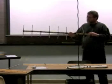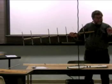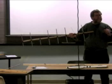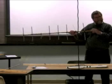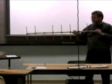But when you get real close with this kind of antenna, what you can do is put that attenuator in there and put a whole lot of dBs of attenuation between the antenna and your radio, and then even though you're fairly close to the transmitter, the signal is attenuated so much it's still fairly weak and you still get this directivity.